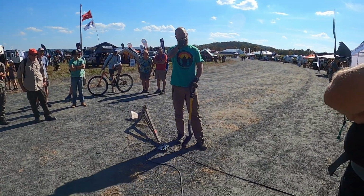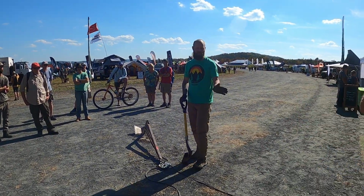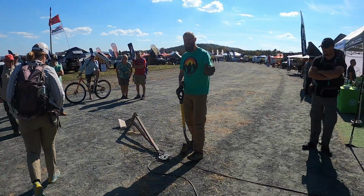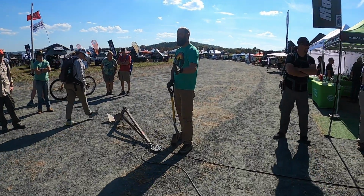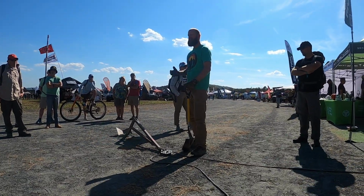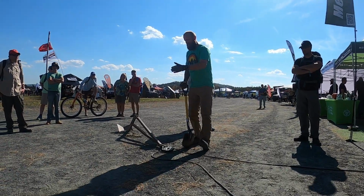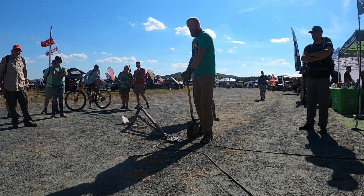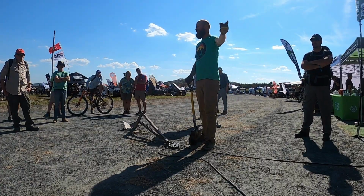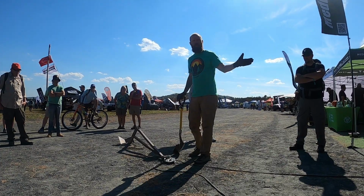Also, now we're looking at our point there. Where's the most dangerous point to stand? In the triangle of death is what we call it. The Bermuda Triangle, right? Once this has tension on it, the point that's going to have the most pressure is this pulley block. So if something did fail, if I had bad equipment or whatever, I didn't buy my equipment at Cape Fear Customs, right? Nice plug. Yeah. If it did fail, it would fail at the pulley block and it's going that way, right? You can put line dampeners and all the fancy stuff on there, but it's going to go with some force. So we want to protect this area.